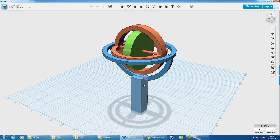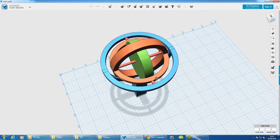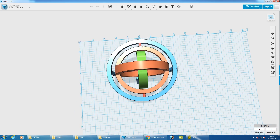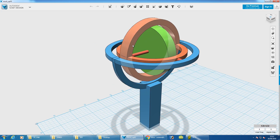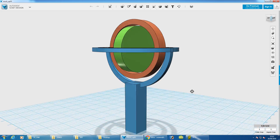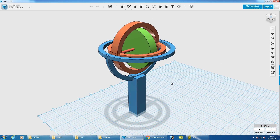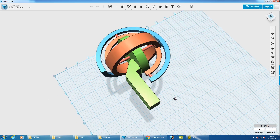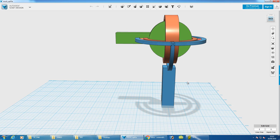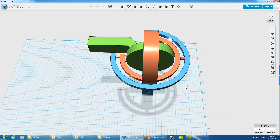I thought about combining two axes — in the shoulder we could get two axes, one inside the other, with some sort of gimbal. We need a fixed piece and a moving piece. The red part rotates one way, the blue part rotates the other way where the arm is. These large surfaces can act as pulleys — one would move the arm left to right, the green one could move it the perpendicular way. To attach the arm we need to anchor to the green part, so I cut into the rings to anchor it perhaps to the back collar of the suit. Making that part of the gimbal as well is going to be a nightmare.